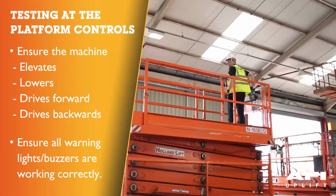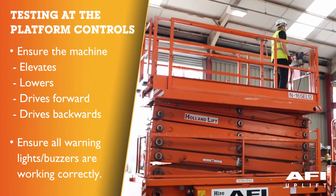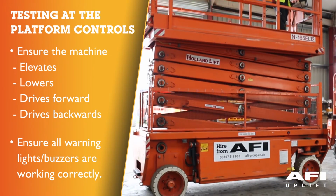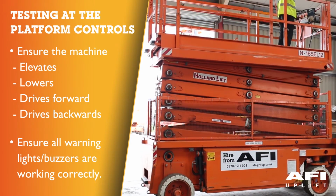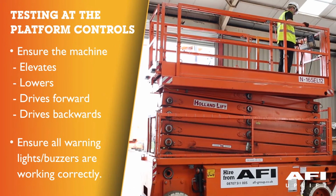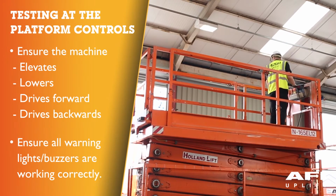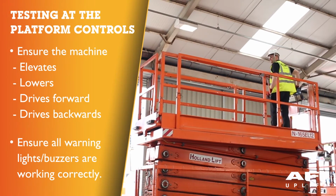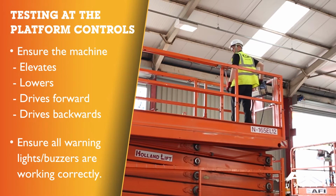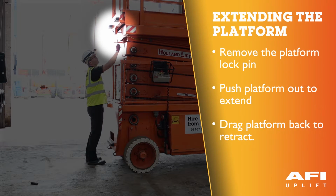Now carry out a systematic check of all functions, ensuring that the machine elevates and lowers, drives forwards and drives backwards, and that all warning lights and buzzers are working correctly. To extend the platform, ensure that the platform lock pin is removed.